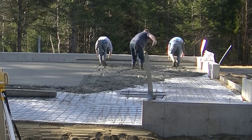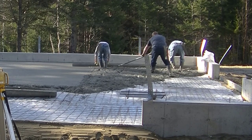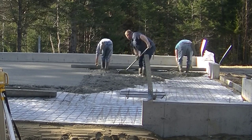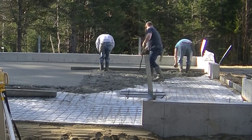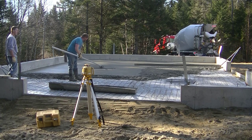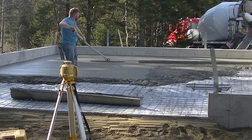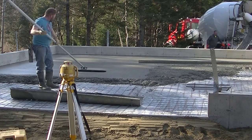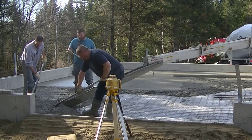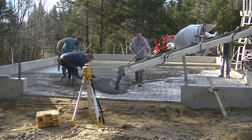The sun's really starting to pop up now — it's about 7 a.m. We generally always start first thing in the morning. We like starting when it's cool and early. If you get the first round of trucks, they're never late — always on time. That's a big deal, so we always schedule concrete for 6 or 6:30 every single morning, lined up two weeks in advance. We just line up our jobs and hope the weather cooperates. There's the first truck dumped out — took maybe 15–20 minutes to get it dumped and screeded. Now we're on to the second truck.